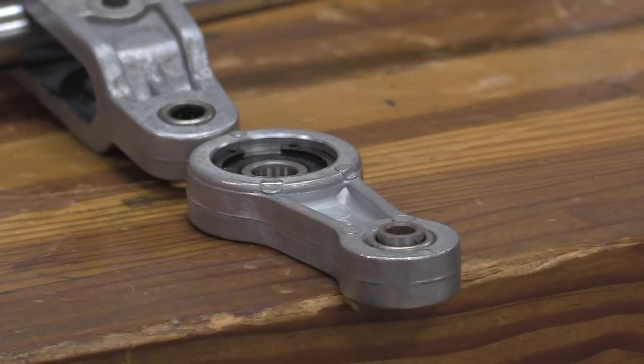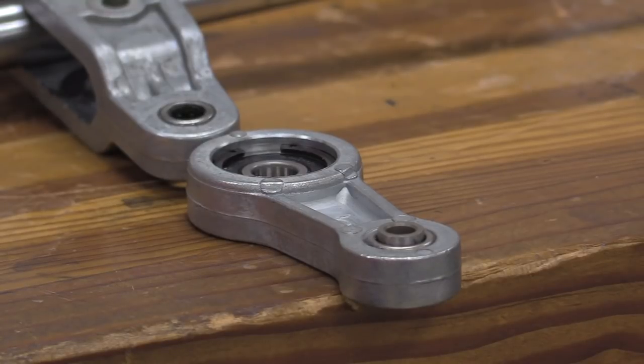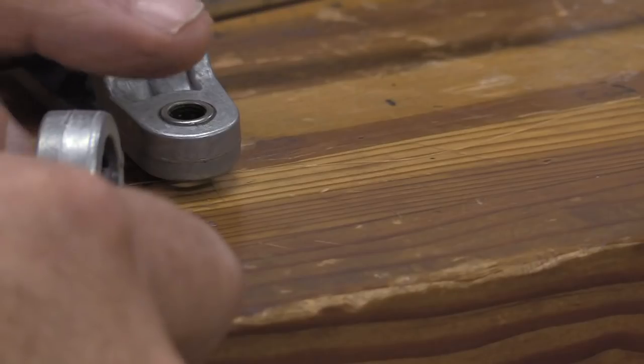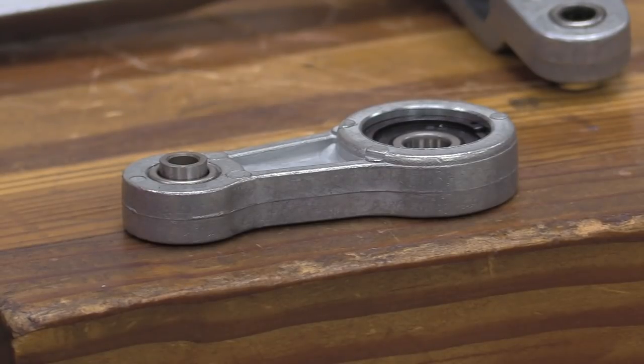You know, rather than me trying to scrounge around and line up a machinist to make that thing and then send it out to harden it, that's a lot of risk involved. You could wind up with a lot of bad parts, a lot of rework, all that kind of thing. So I just go ahead and buy the whole assembly. This one is the new style. Because of this bearing and sleeve in here, this is one of the highest stress parts of the machine. So on probably a third of the saws that I have to service that are making noise, I usually have to wind up replacing that part, especially if I didn't get to it before the lubrication ran out.